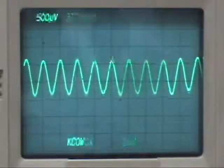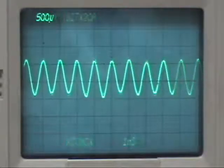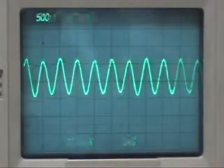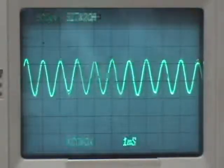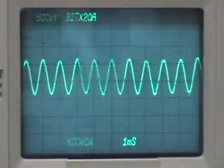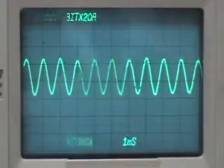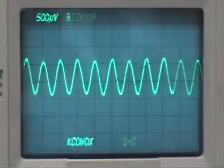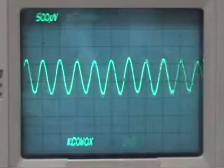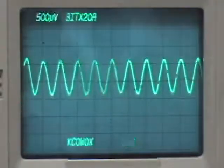To test the audio amplifier, I tried touching the volume control pot with my finger but I couldn't get anything to work that way — I'm just not a very good signal injector. So I have a signal generator hooked up putting out 1 kilohertz. As you can see on the left-hand screen, we've got about 1 millivolt peak-to-peak amplitude. We'll switch over to the speaker lead, measure the output, and calculate the dB gain. The schematic says we should have about 36 dB gain.